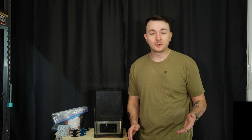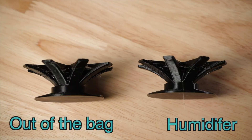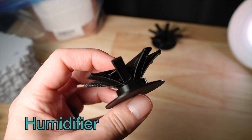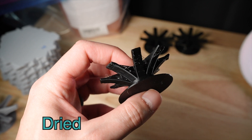It's the next day, and two things right off the rip. Number one, strep throat jumped up and bit me overnight, so my voice sounds scratchy. Two, my science experiment did not really work the way that I meant for it to. I think maybe six hours in the box with the humidifier just wasn't enough time, especially for PLA, so there was really no difference between the three prints — right out of the bag, after the humidifier for six hours, and after drying. But I'll show you guys the prints so you can make up your minds for yourselves. On the left we have right out of the bag, and on the right we have after all the water, and honestly there's just as much stringing in both. Here's a close-up of right out of the bag — there's a bit of stringing — and here's after the humidifier for six hours, mostly the same, and this is after I dried it, which is still kind of the same.